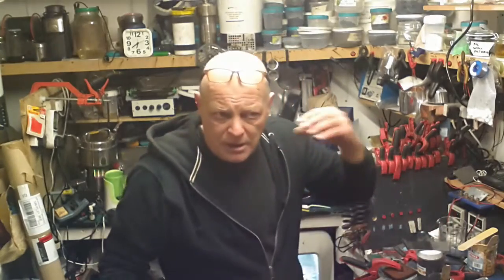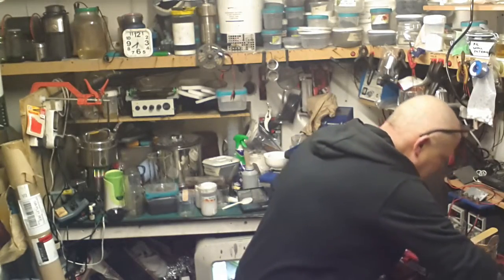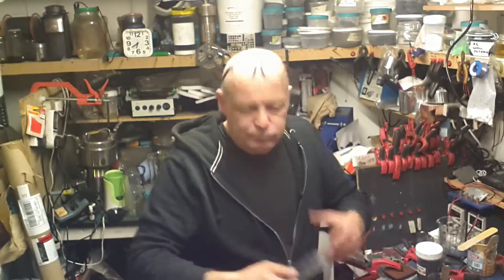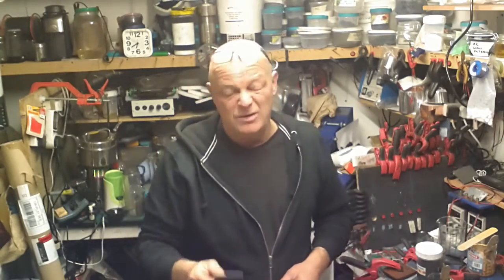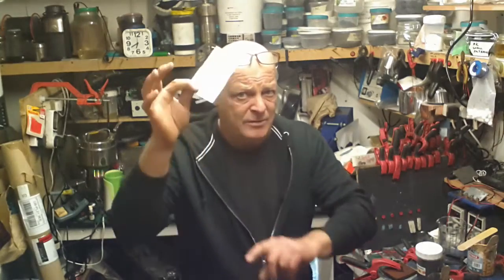I've done away with the graphite that I was using on the cathode as the collector plate. I've produced my own graphite blend, and it's on a piece of aluminium there. You'll see all sorts of marks from my probes on it — I was testing it for conductivity while it hadn't gone off completely. I've tested that on a battery. That's aluminium, and it works.